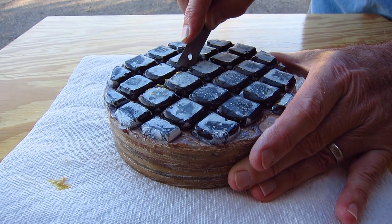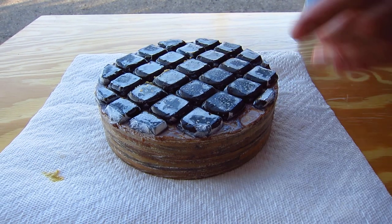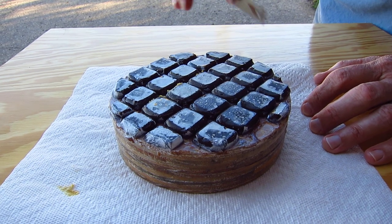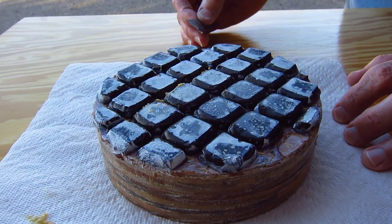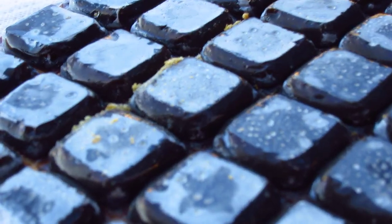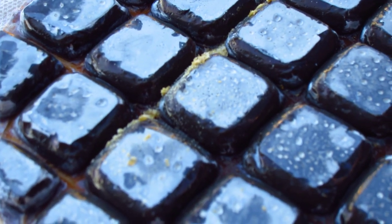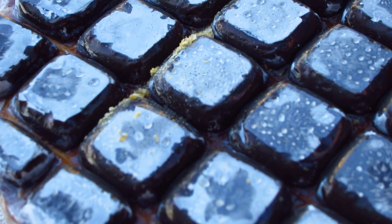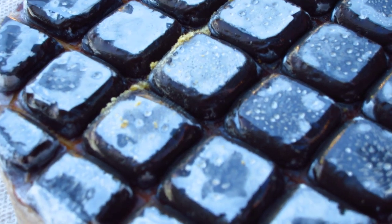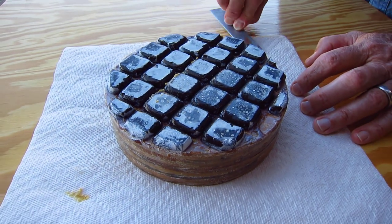As I mentioned, I was showing Dimitri how to do this when it gets a little bit more severe. But at the moment, these particular tiles are not too close together for this to be an ineffective polish. In Dimitri's case, we're using this particular six-inch sub-diameter pitch lap to do some figuring — he has a flat middle in his 12.5-inch mirror, and we're using the six-inch diameter pitch lap to basically gouge out the central portion of the mirror.